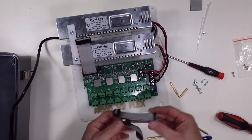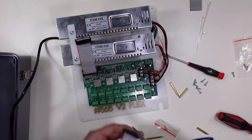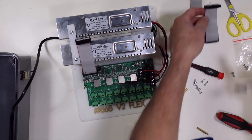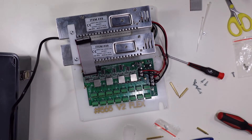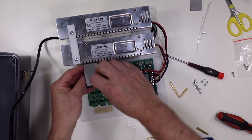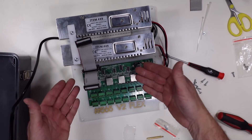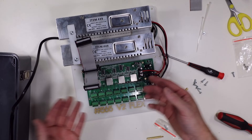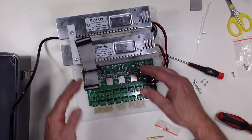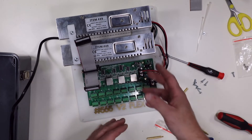The next thing is to get the next connection. We're going to trim off the extra cable and plug this in. We can see it's plugged in now, so both connectors are ready to go. It's important to note that boards start off with their numbering at the top — there are 48 total ports possible. Port one is closest to the back, then one through 16, 17 through 32, and 33 through 48.